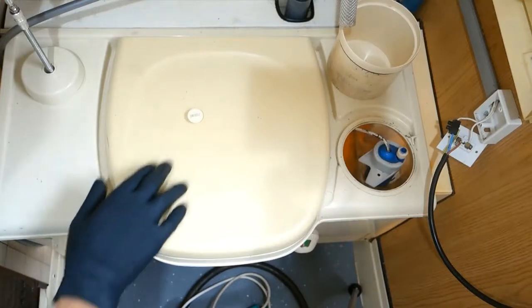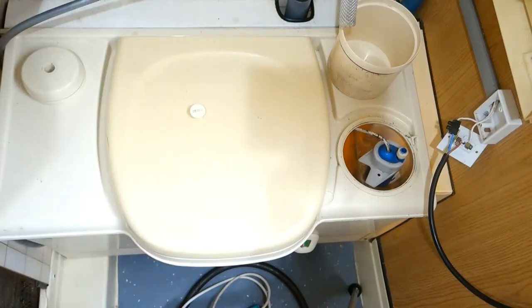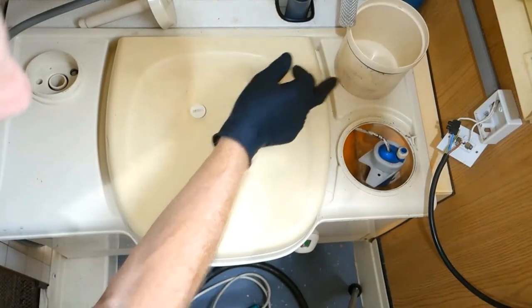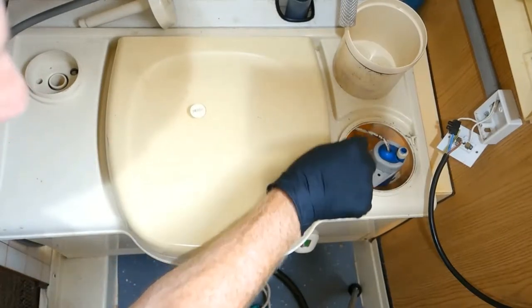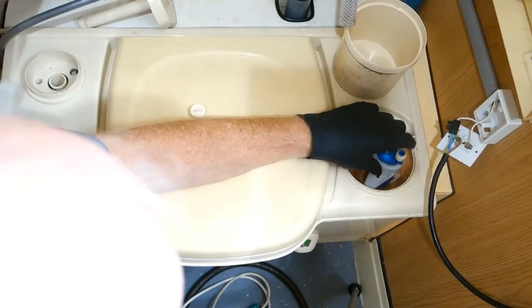So I've started. I've removed the cap from here and the long screw that's in the recess of that. I've removed the toilet holder — I put some WD-40 around that and it managed to ease it out — revealing the pump, located just inside here, held by one screw and this little shoulder piece.